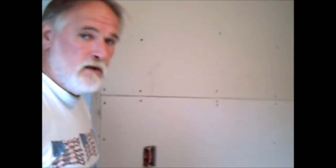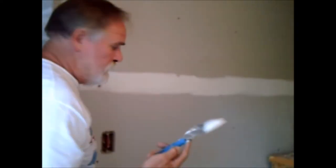What I'll do is run right up these steps for a couple of steps. I've got my joint compound right here, and I'll step up and spread my mud out toward this doorway where you can see what's going on. When you're spreading the mud, you want to spread it evenly, and you don't need to put a full 6 inches wide of joint compound. I'll probably alternate between calling it mud and joint compound, but you can just put a healthy dab of mud on the corner of your knife and set that right on the joint and spread it with even pressure, and you'll be in business.